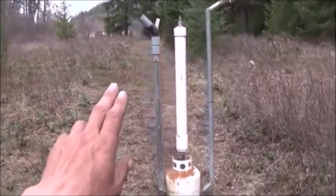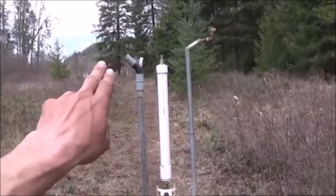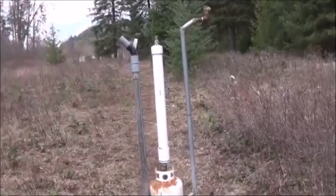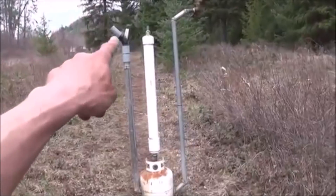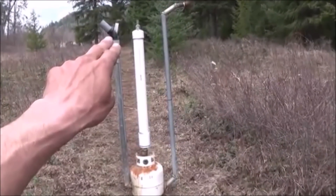From back here you can kind of see it. Water is going to come in at an uphill slope, so I'm going to have about 20 feet of head come into that angle you see right there from uphill, running down into that. That's going to be our flow into the system. It's going to run past this elbow — which I'll show you up close — that's where it's going to draw the air in. The Tromp design is right there at the elbow.